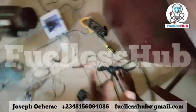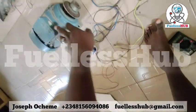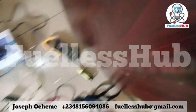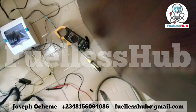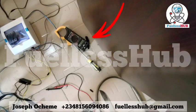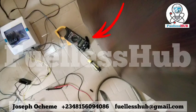I'm going to do a manual startup of this. Here is the box, here is the line that leads to the power source, and here is the electric motor we are going to use — here is the specification. The starting amps should be checked right here. Let your eyes be on the meter because you're going to see the starting amperage. In every circuit there is a starting current and a running current, so let's go with the starting first while I power the motor manually.